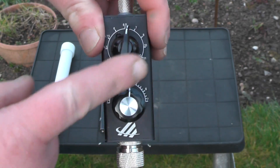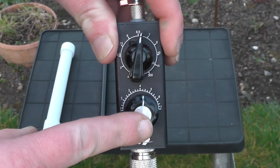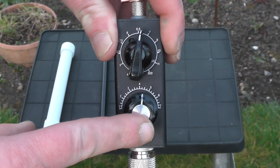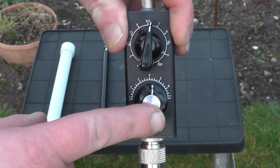What I can make out — because it didn't come with any instructions — this one makes the signal louder, and this one makes the SWR come down. I had it around on 2 metres at about 1.5, and on 20 metres about 3.8, so I will be playing around with this some more.